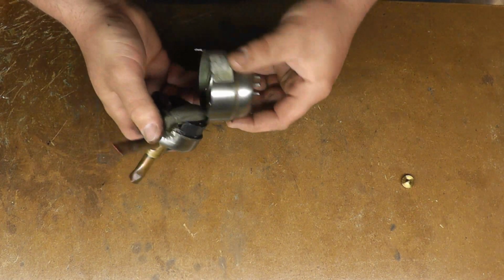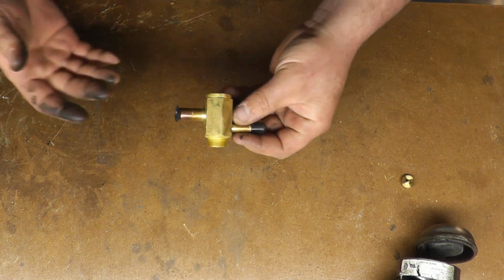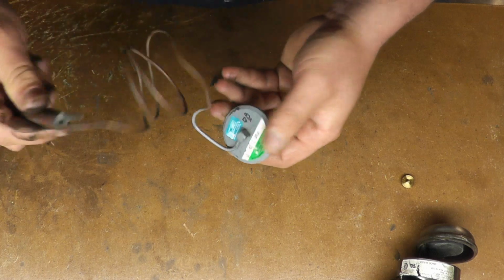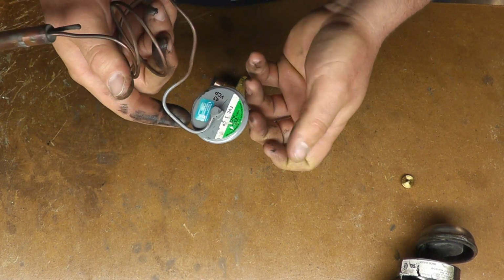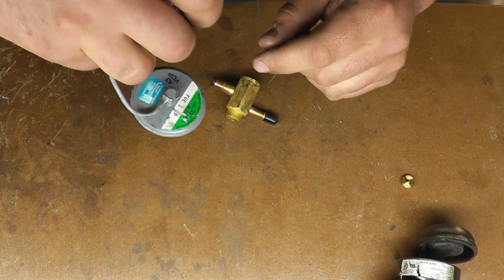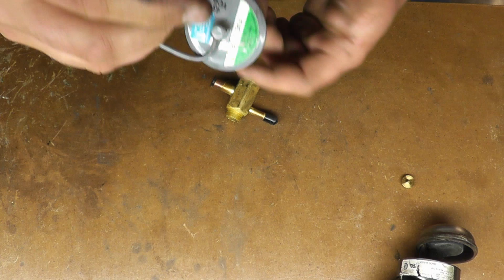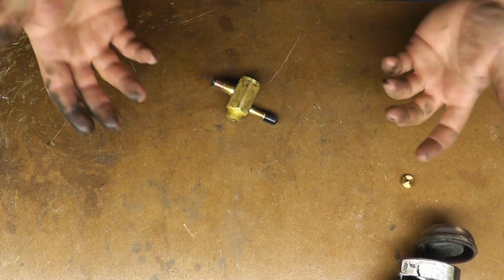I mean, non-serviceable parts, and at least this I can, in a pinch. It's Friday at 5, 6 o'clock. I got a bad valve. At least I carry sets of heads in the truck. I carry a medium temp and a low temp head usually. One 404 usually. A lot of times they have combo heads that are multiple refrigerants, but you carry a medium temp and a low temp head, and you can at least get them by for the weekend before you can get the part.